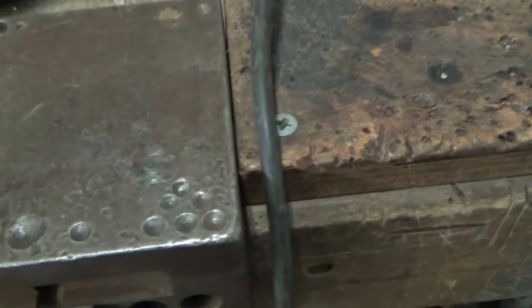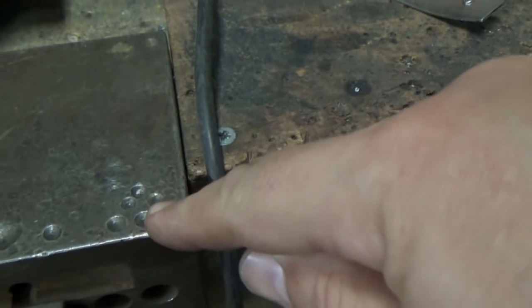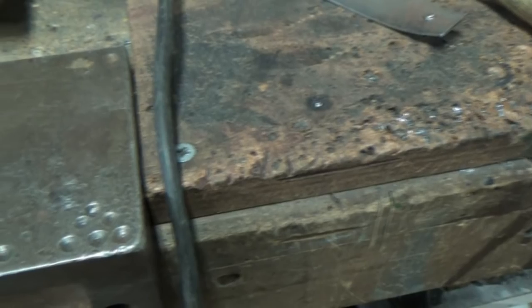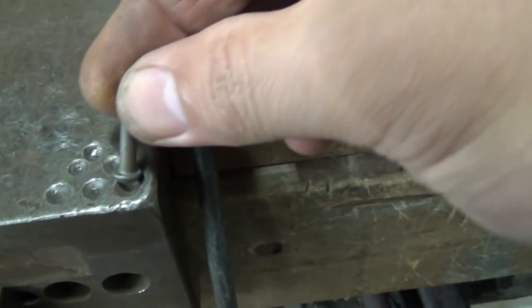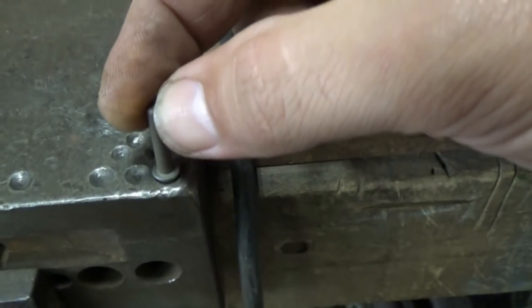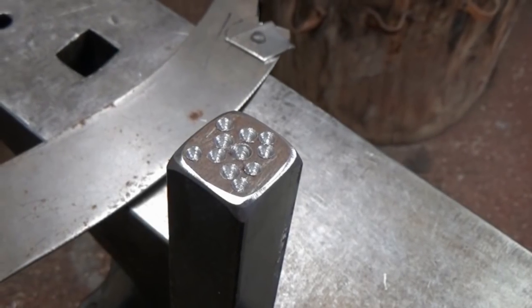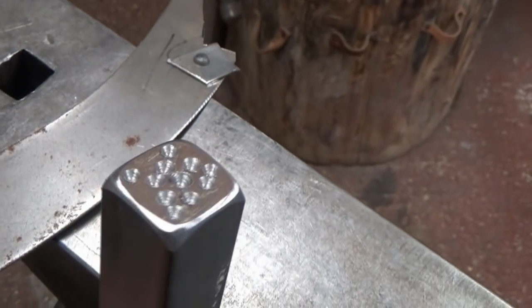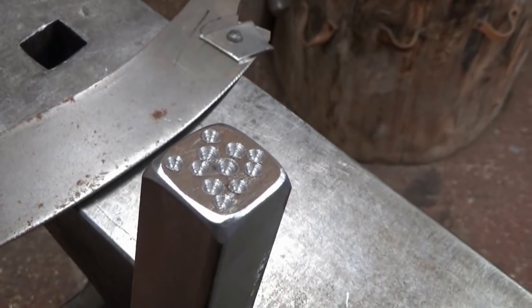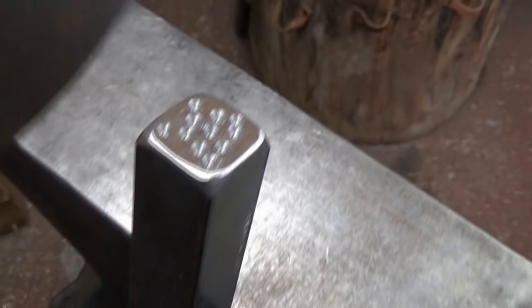When I first started armoring I found this piece of metal in a second-hand tool shop — I've no idea what it did before. All I did was drill some holes in it, barely a couple of millimetres, with a standard drill bit of different sizes, to make a riveting tool. When I offered up a piece of material, it would sit in the hole and wouldn't damage the rivet heads. It's quite straightforward — I think some people call them a rivet snap tool. Very straightforward to make; you just do different size holes as you need. There's nothing specialist about making one of these tools. This is a bit of 22mm square stock that I had lying around in the workshop — I've just drilled a series of holes in there.